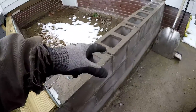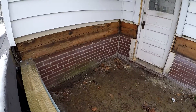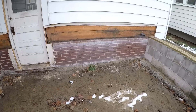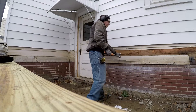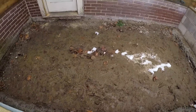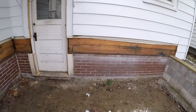This one's on, and I got this one next. I'll start figuring out my band board — that door's going to have to come out. Now I got the aluminum off so I can get my band joists on. Actually, it was redwood underneath it. It's just enough to get the floor on; the rest of the demo will be done after the floor's on so it doesn't all fall in the crawl space. I had to cut away the trim on the side of the door so I can run the band joists past.